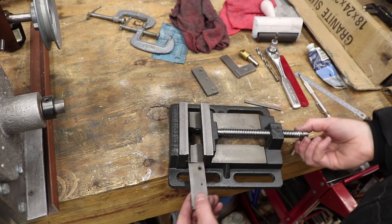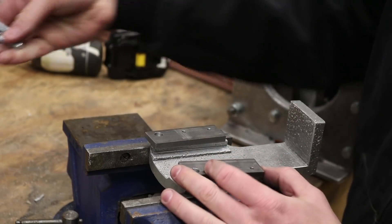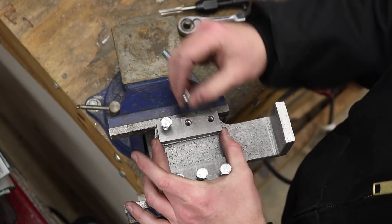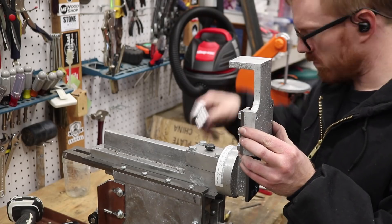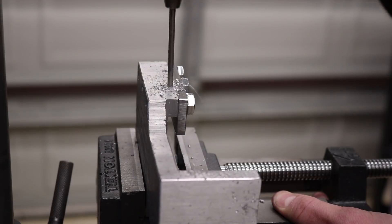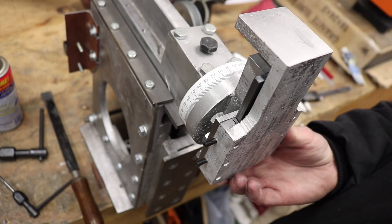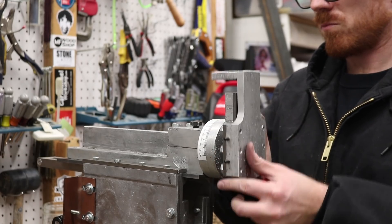This is pretty much the same procedure that you've seen in previous videos where I make a series of holes, enlarge them, tap the casting, install the fasteners, and then align the clamps so that I can repeat the drill for the remainder of the fasteners. I installed all the fasteners onto the downfeed. I did a little bit of filing on the Gib to make it fit under that clamp beside the downfeed slideways. Then I took the downfeed back over to the drill press to drill and tap holes for the Gib adjustment screws. These screws are on the left side of the downfeed and they adjust the pressure that the Gib exerts on the downfeed slideways, allowing me to adjust that Gib so that there's minimal play in the downfeed.